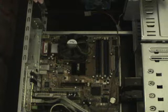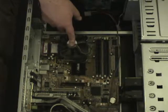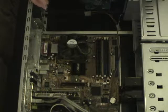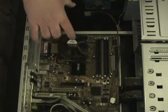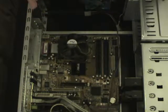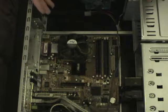And there's different motherboard layouts. Some of them actually have it so that the RAM is going to be cooled by the CPU fan. If that's true, you have to get something that's going to blow across the RAM for cooling if you get a vertical heatsink. Remember, just take a look at everything that goes into the computer and think, is this going to work thermally for the computer?